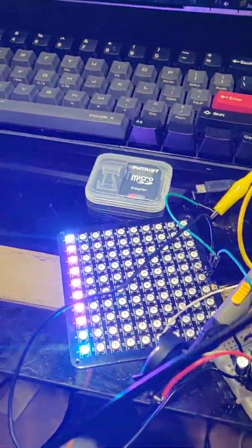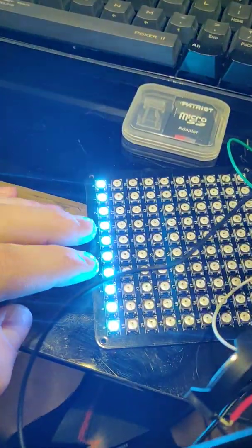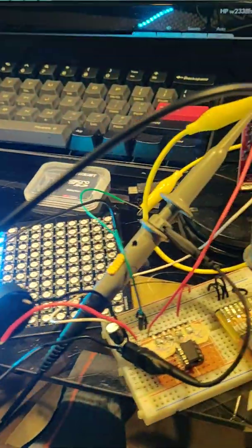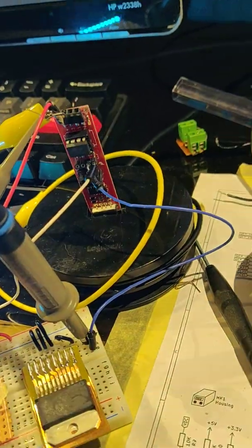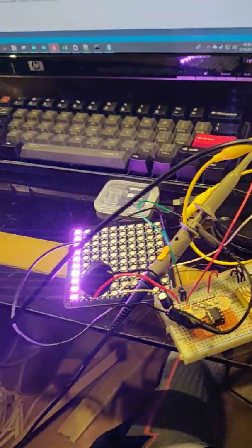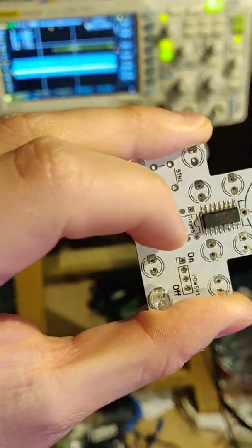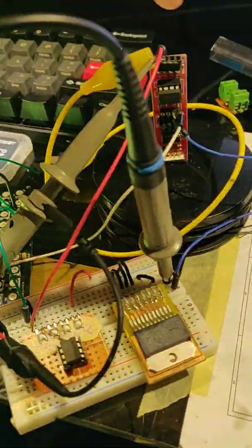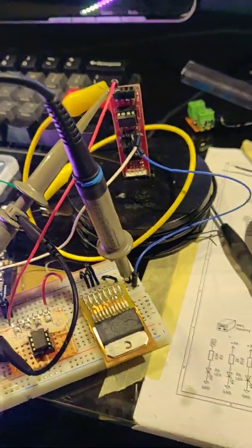Hi, Dr. Bai. So, I'm starting to do some testing with the RGB SMD LEDs. Right now, I'm using a Tiny 85 processor. Is that the DIP 8 chip there? It's the same one that's on these Tiny Ts. The Tiny 85 right there. And I had to change some of the clock source and the fuses inside the chip.